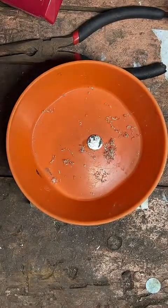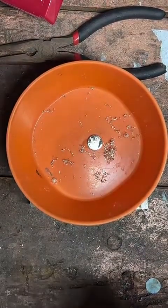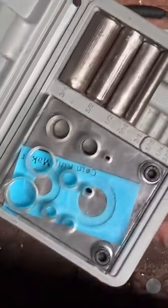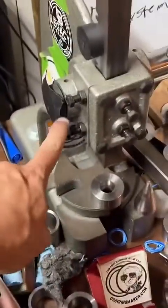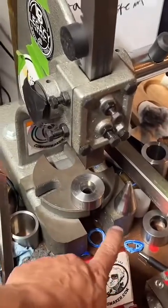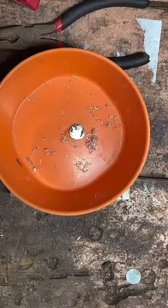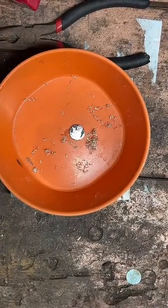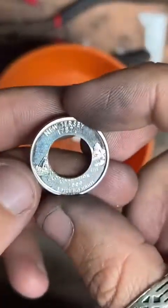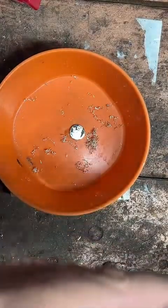So when I first started, I spent about $150 on tools. I got a hammer, I got a punch and die set like this. Punch holes worked pretty good. And I got a 1-ton arbor press and a die and a cone. And pretty much from those five tools, and a mandrel, you need a ring mandrel too, you can make rings with those basic tools. I definitely upgraded to some fancier tools over time to make it a little easier process.